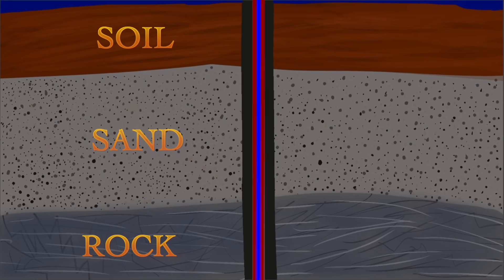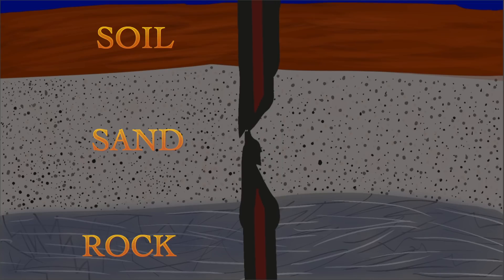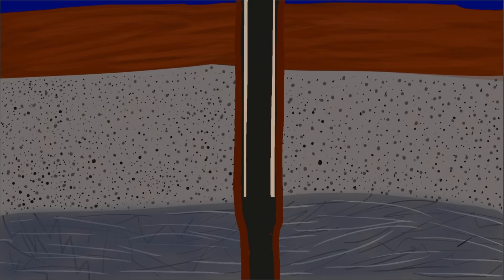eventually the soil on the top of the surface — everything above the rock layer and up — is all the stuff that has a potential of falling in. Some places are just clay and usually do not have this problem, so sometimes you can just drill a hole without any need for upper casing. But in our case we started having some cave-ins, so we decided to put it in. Basically what this casing is, is a large casing that goes down — in our case 14 feet, sometimes deeper than other wells. What it's designed to do is to keep cave-ins from happening.